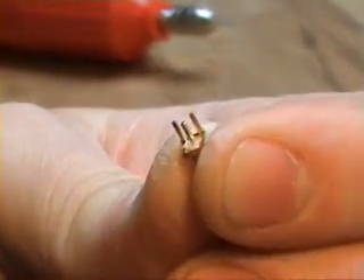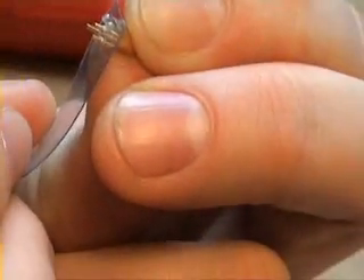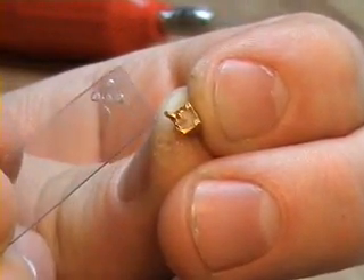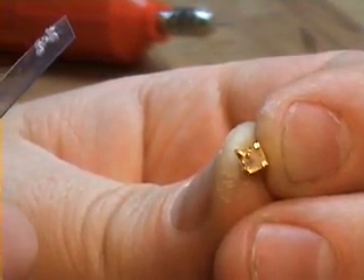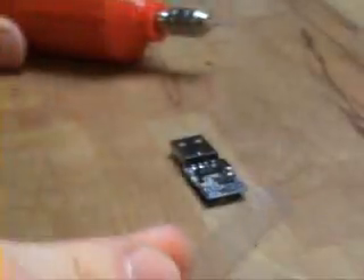I've got the centre pin and two outer pins. I've made this simple tool out of a sheet of plastic. I originally pressed the antenna socket against it — you can see I can use this to mark out where the holes need to go on the circuit board, where we've just erased the traces using our Dremel sander tool.